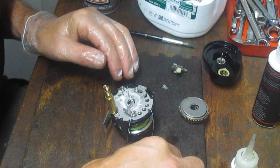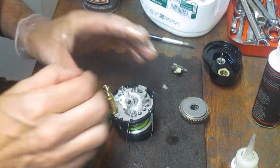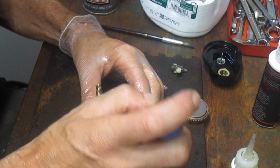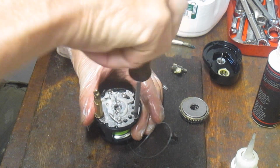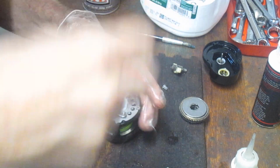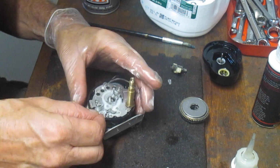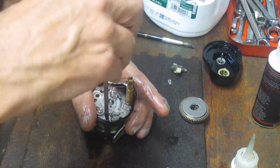So let's grab the 3 case screws, put those back in. You put a little bit of oil on there to keep those threads nice and tight. Again, if you had lost where the orientation is on these screws, then you would go back to your pictures and say, oh, one belongs there, and so on. These have little bump outs in it. It's easy enough to get these confused because you have case screws that are going to hold the other piece on as well.